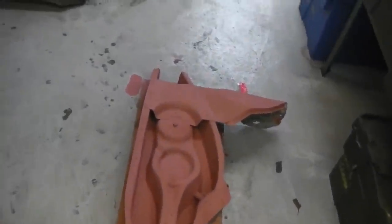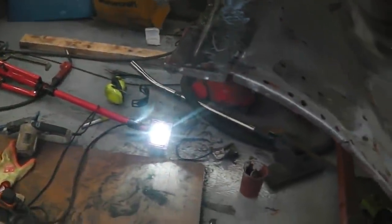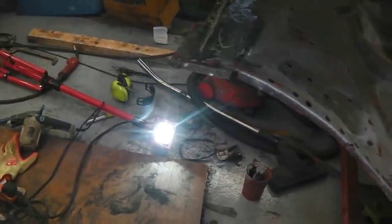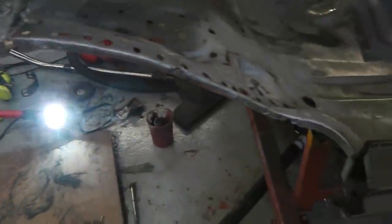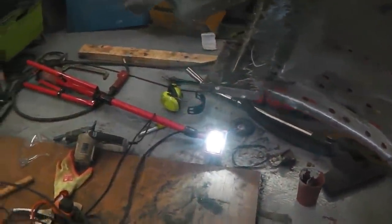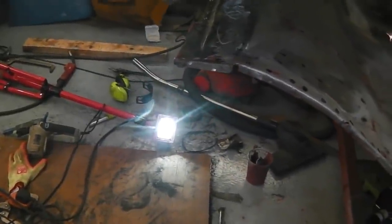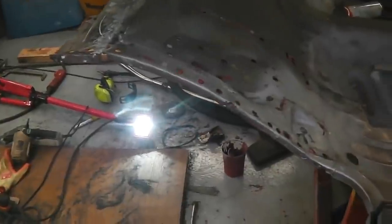We're going to join the remaining chassis leg later on, because otherwise it's going to get in the way. What do you reckon? It's going to be sticking right out, and we can use the boot to help us get the exact slide forward or back into the front section of the chassis. So I wouldn't want to get it wrong, so I might as well leave that till later when the boot floor arrives. So that's where we're up to there.